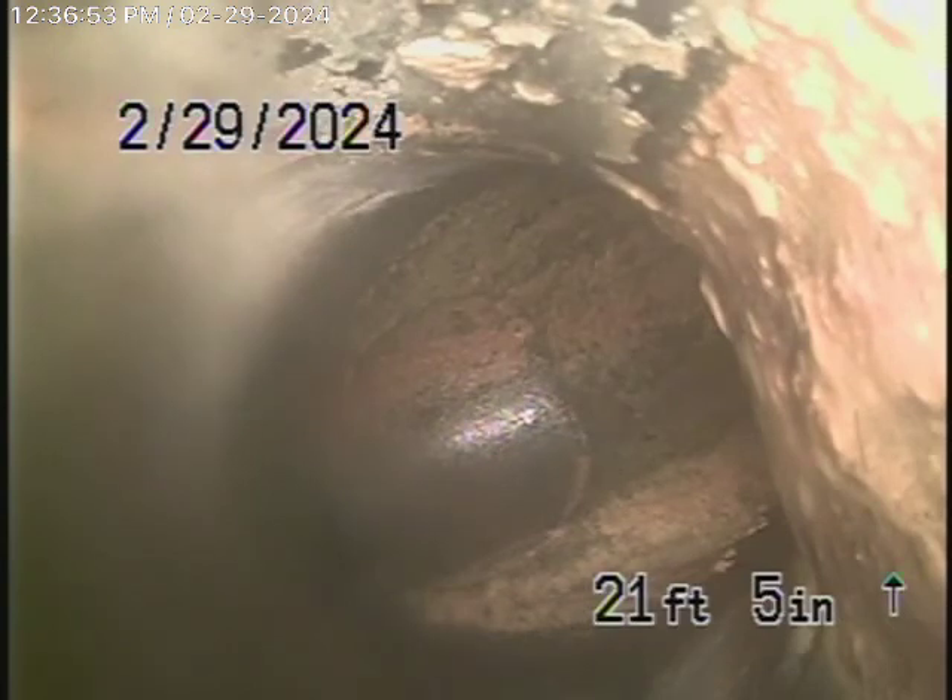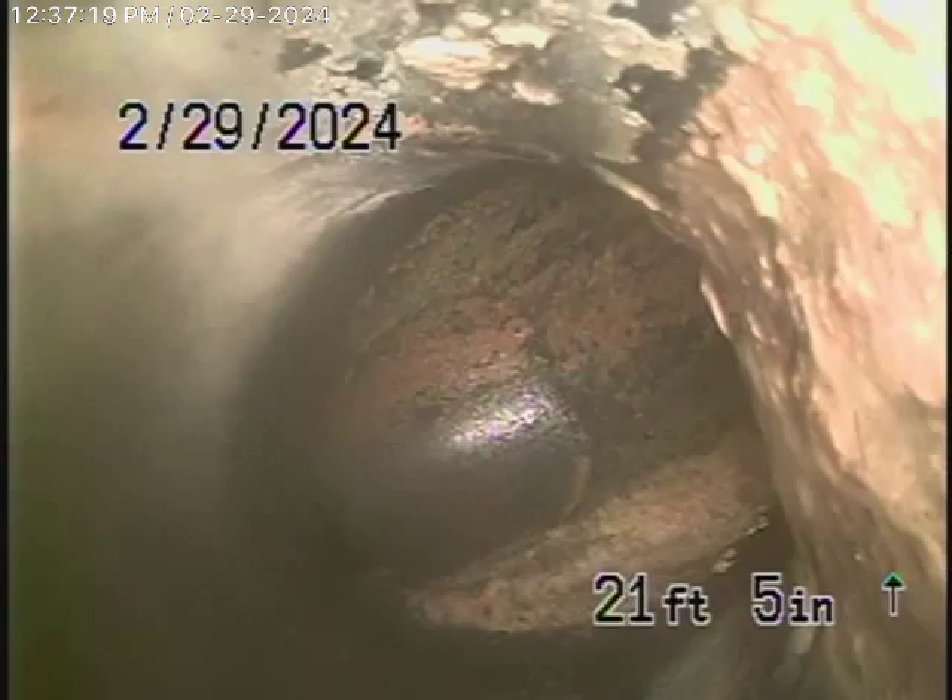It looks like there's pretty much ABS plastic with a few cleanouts around the house. We started from a cleanout halfway up the wall next to the air conditioning units and have gone in about 20 feet where we've come to a sharp turn in the line. We've already been through a few turns and definitely won't be able to make it through from here. We can see ABS plastic and we're going to continue our inspection from another spot.